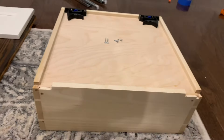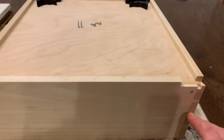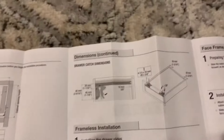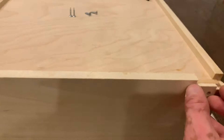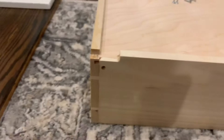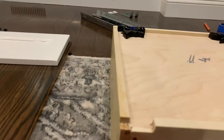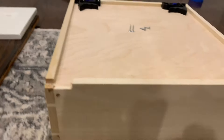In the back of the drawer you need to have a cutout here for the slide to sit on either side, and also holes drilled — quarter-inch holes for pins on the sides that will hold the drawer on the back side. The directions show you how thick the cutout needs to be: 1-3/16 inches long, cut out all the way to where the drawer side sits. The quarter-inch holes need to be 11 millimeters up from the base of the bottom and 6 millimeters in. I made this drawer box using my CNC.